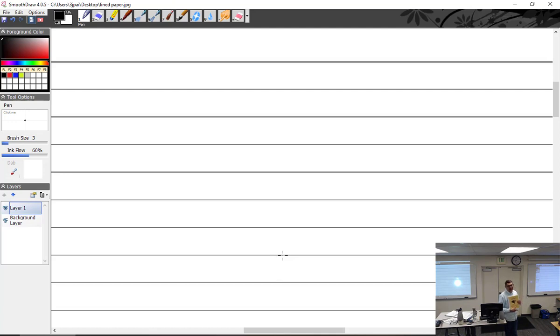So if you own this and you're doing work on your airplane, you must also own those service instructions. If the FAA shows up and asks what data you're using and you say 'I just bought this yesterday from Lycoming — it's good for three years,' they'll say read page two. Because right there it says you have to have service bulletins and instructions because they're an integral part and shall be used in conjunction with this book.